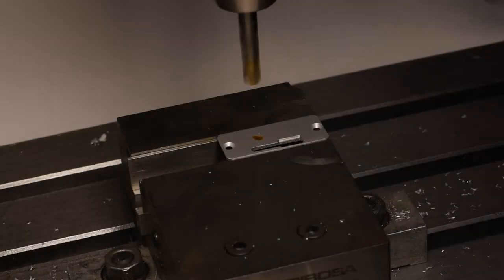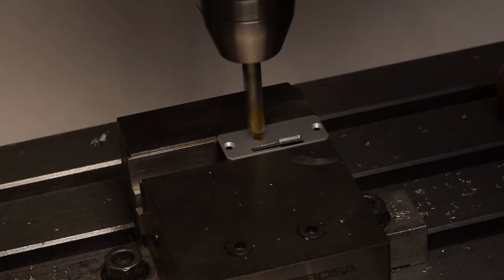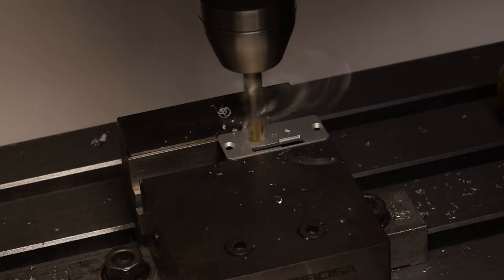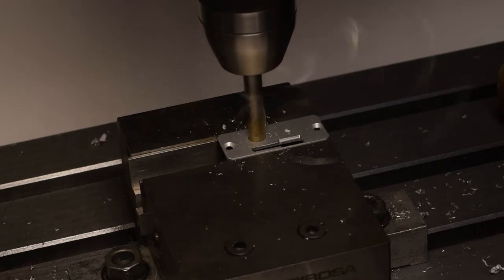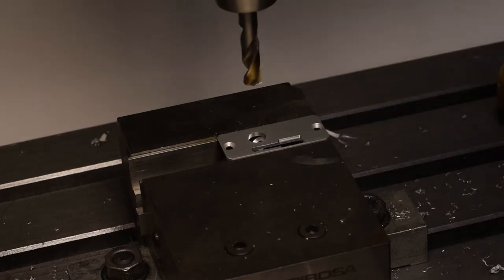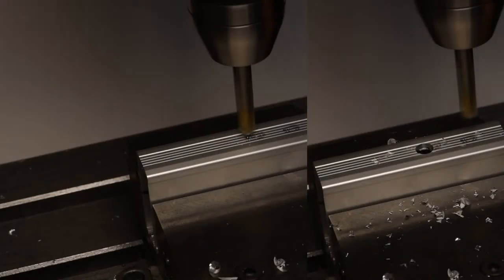One thing is still missing from the forward-facing plate of the device, and that is a hole for the BNC connector, which will relay the trigger, for instance, from the measurement device, which gives the single triggering pulse. This is not one of the six connectors which we have marked on the sides of the case and on the back facing plate. This is a seventh connector.